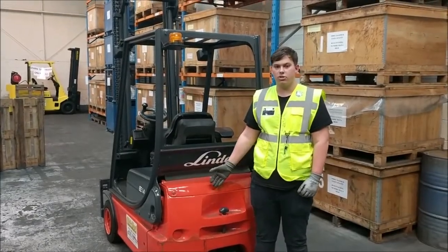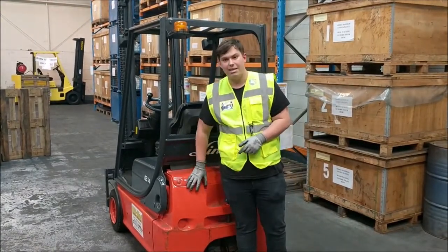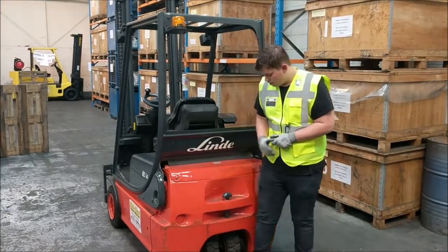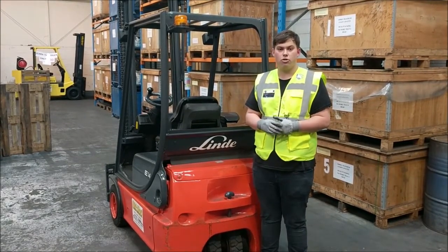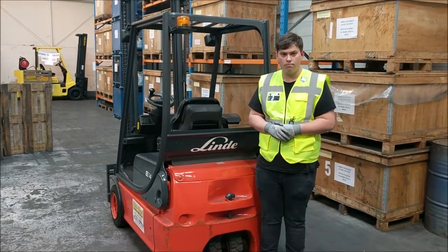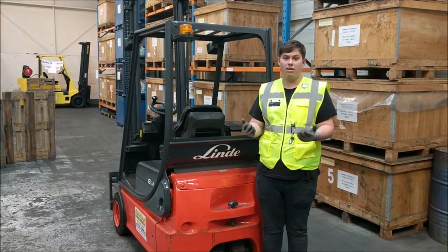Up next, we're going to take a look at the external condition of our truck. We're going to take a look around our truck ensuring that there's no damages. Specific attention should be paid to the rear of the truck, as this is where the counterweight and the battery or gas bottle is located. Any damage to the rear of the truck will affect the truck's capacity and therefore derate it. Next, pay attention to our towing pin — ensure that it's in place, as that's there to make sure that if the truck does break down, it can be towed out safely. Any damage to the rear may be indicated by a scratch that is new — those may be a different colour to the truck. When that's the case, you can take a walk around the facility to ensure it hasn't hit anything and caused major infrastructural damage.